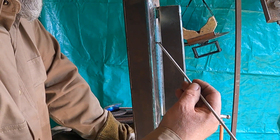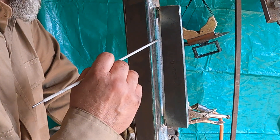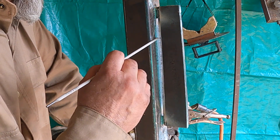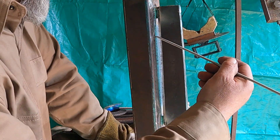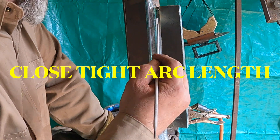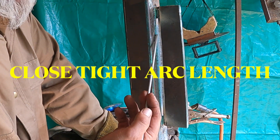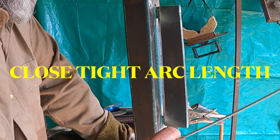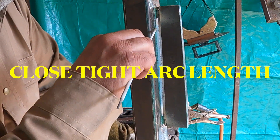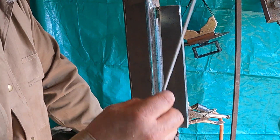So that's where you're going to have your angles. You'll move this back and forth and around. You'll stay here a lot, and when the keyhole gets too big you're going to go back into the base metal and keep working it back and forth as you go up at 5 to 15 degrees. You might go a little bit more of a downward angle, but not much, because you want to penetrate it and walk it as you go and add the metal in.